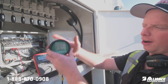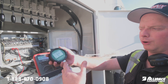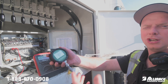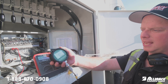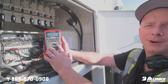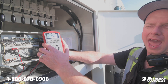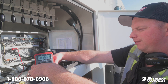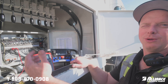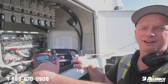You don't need a fancy snap-on or fancy stop gauge. You can go and get a liquid-filled gauge that's maybe 0 to 60 bar or 0 to 1000 PSI and do the same troubleshooting. Same with a multimeter — you can pick one up; all it has to have is the amperage setting. We're only doing about one amp. If you have any questions on troubleshooting or anything with your volume, please give our service department a call — we'll help you out. Thank you and have a great day.